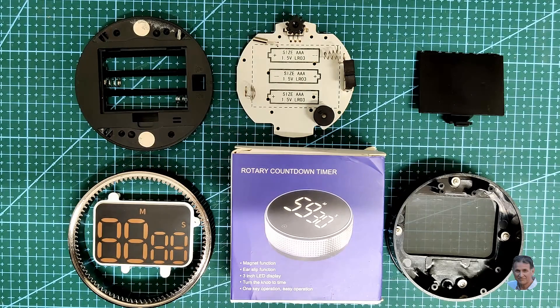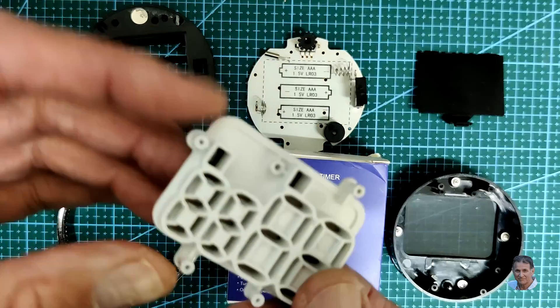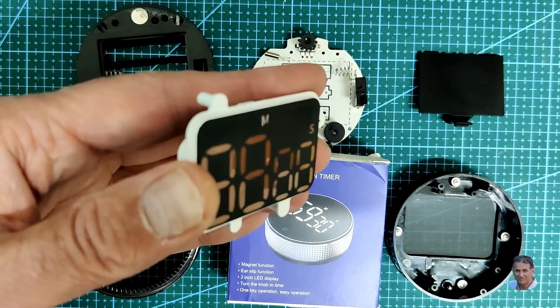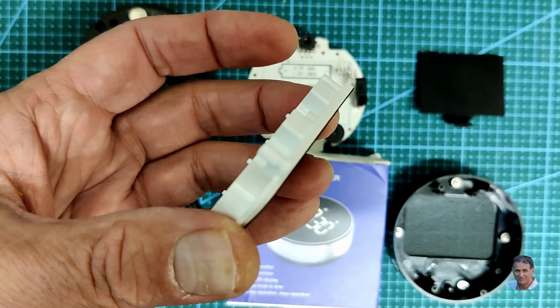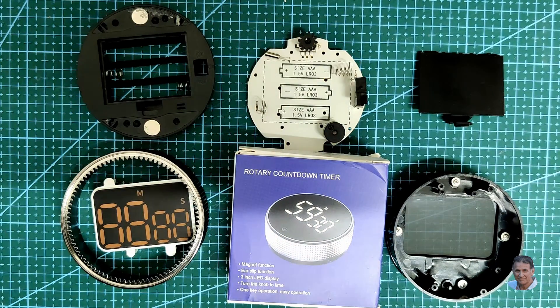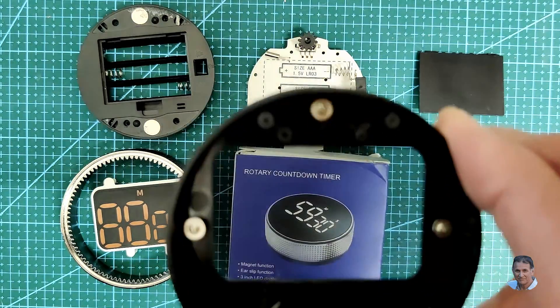Here are all the parts. The diffuser assembly is about 6mm thick. This has the big advantage that if you wanted to hack this device, you could insert your own electronics and display instead of the diffuser, and still keep the main board intact. You could cut the PCB tracks to the rotary encoder, the sounder, the button and the battery connections, and maybe some LEDs, and reconnect your own electronics.